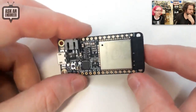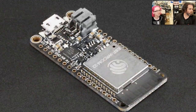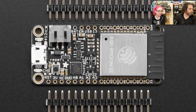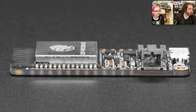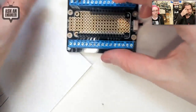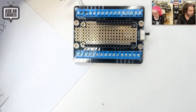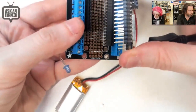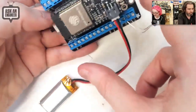Under this module is the ESP32 itself and also 16 megabytes of flash memory. We took this module and — very luckily, because we had already designed the Feather — the module fits exactly in between the pads, so it's perfect. You can use it as a Feather, and what's neat is that it's compatible with our entire library of FeatherWings. For example, this terminal block FeatherWing takes your Feather and breaks it out into screw terminals, so you don't have to do any soldering to attach devices.